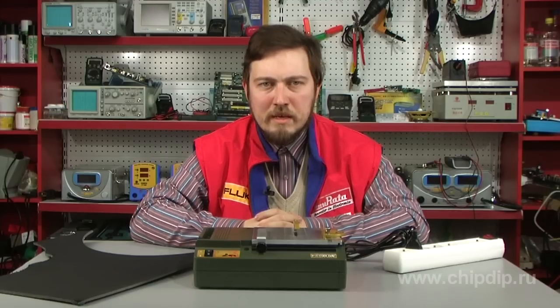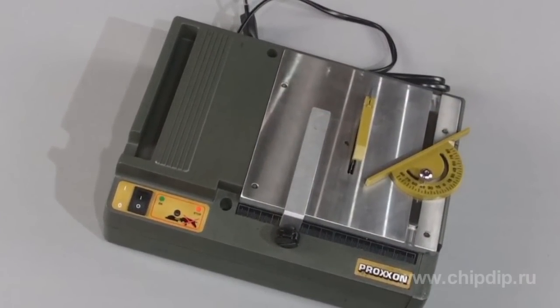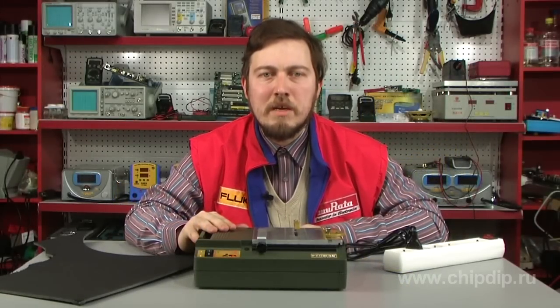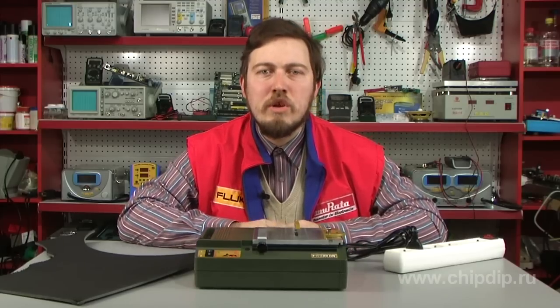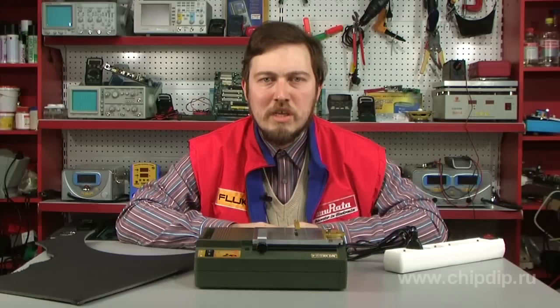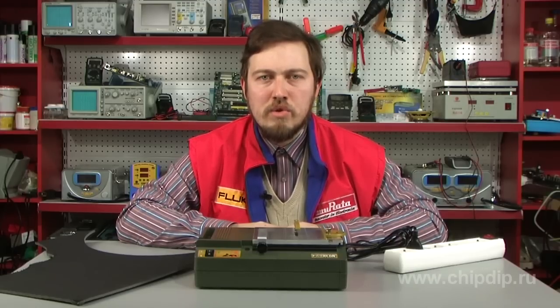The result usually disappoints. The offered desktop disc saw KS230, produced by the company Proxxon, allows you to easily, quickly and, most importantly, precisely cut various moldings with minimum deviations of size of a detail in a series, to cut material under a fixed corner in one plane, to cut several details with a high level of accuracy, to easily make rough cutting of the material, and to make samples of long slots in several passes with sequential displacement of a longitudinal shoulder. The industrial electric motor applied in the saw works from a voltage of 230 volts and has a resource of more than 1000 hours.